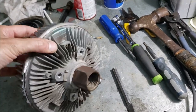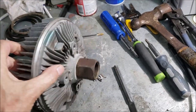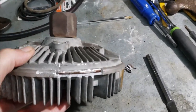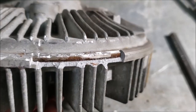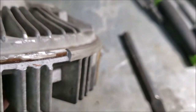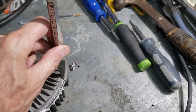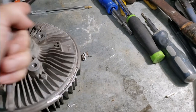First I have to look at it closely to figure out how it was made. I noticed there's a front half and a rear half, and you can see where they rolled the aluminum over to create a seal. There's a rubber seal in between the two halves. I found a chisel — if I put it in here and hit it hard enough I can chip it off, though it's going to take a while working all the way around.